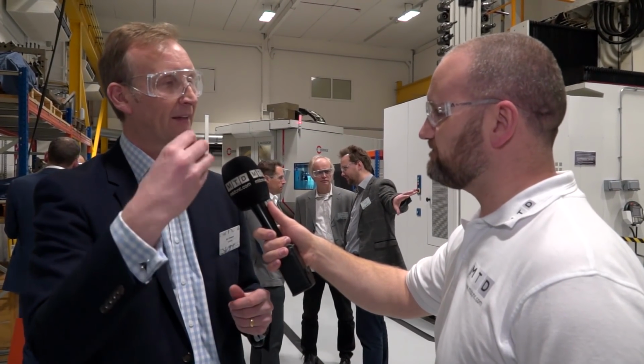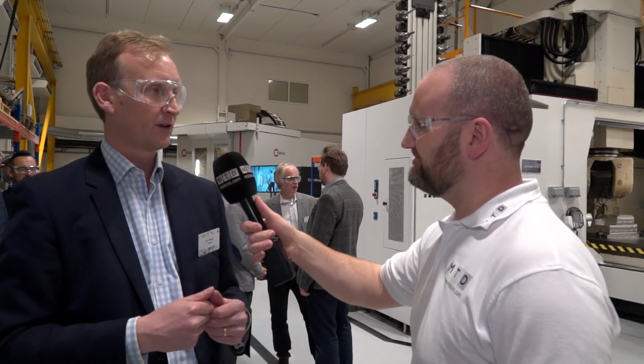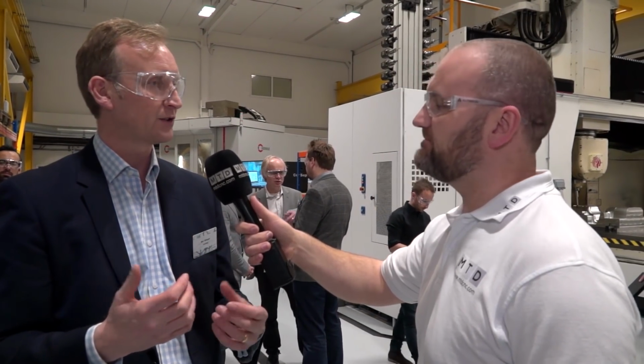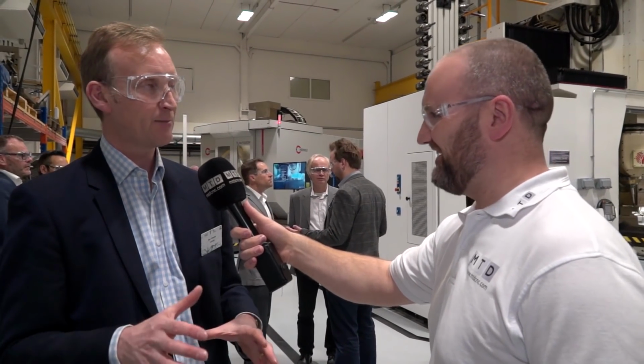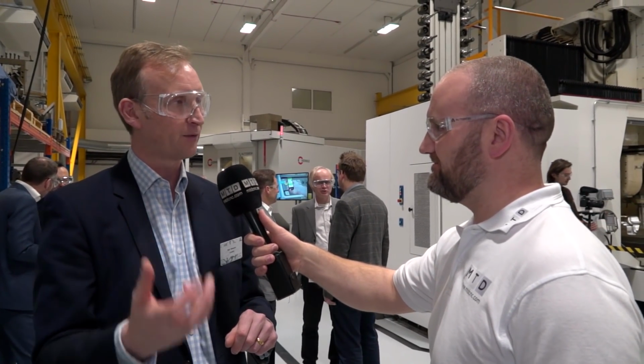Just as importantly, we're then capturing information about what the machine tool is actually doing, and then using that to inform future manufacturing operations. So for example, maybe when we've sent the machining instructions down to the machine, we're expecting it to take 2 hours to run. What we actually discover is that it's taken 2.5 hours, and we can then go back and look and see, has it taken 2.5 hours because the feed rates have been turned down on the machine, or are the accelerations and decelerations of the machine different to what we expected, or has the operator been for a quick coffee break halfway through the shift? So a really powerful tool to enable us not only to manage our business, but to continually drive the improvement in the performance of our business.